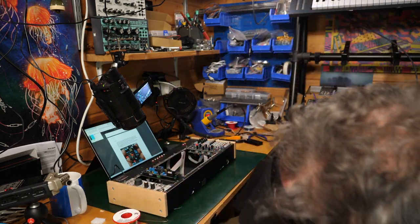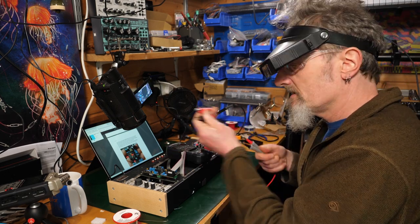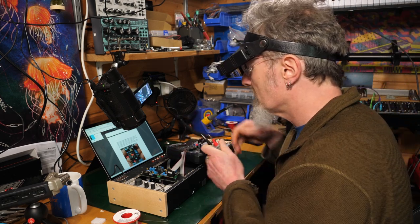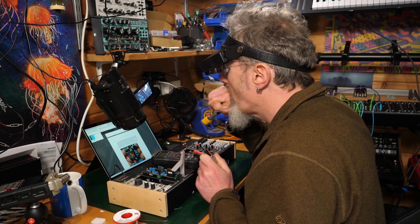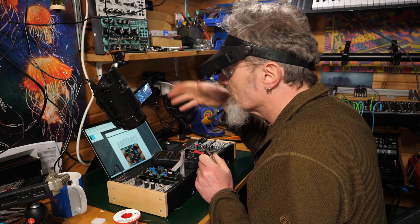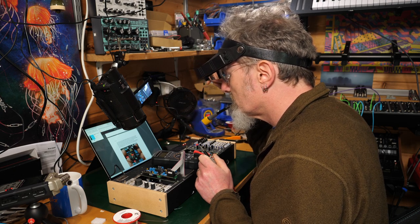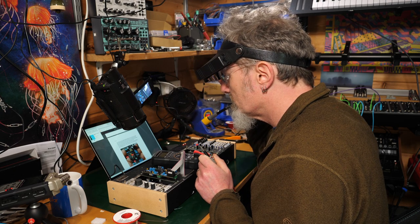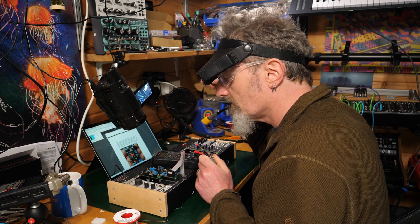So what am I doing? I'm getting a multimeter. You don't necessarily have to have a multimeter to make all this function, I don't think. So trusty multimeter is what it suggests. Plug your cable in the module, preferably using your own bench power supply. Yeah, right, of course. Or a small powered case. Yes, you should get plus 12 and minus 12 between pin 4 and pin 11. And you should get plus 5 over there on pin 1.